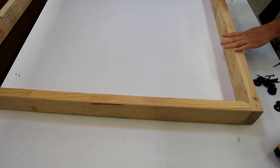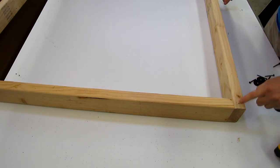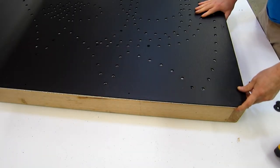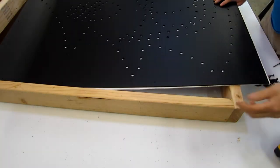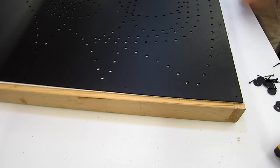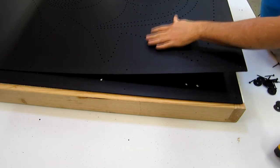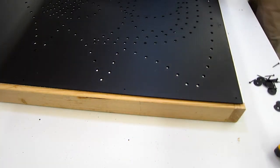All right, we've now completed the frame. What I'm going to do is set it so that the long end of this frame is down at the bottom here, and that the vertical portion here is a short stud. Now, when you get your Coro, there'll be one face that has holes in it with no drawing, and then there'll be another face that has holes in it, but with drawing. The bottom of your design is going to be inside of the 2x4. That applies to not only this type, where we have mini lights, but also our RGB units. So, you want to make sure that you put the holes so that the individual lines that show where to put the lights are facing down into the 2x4s.